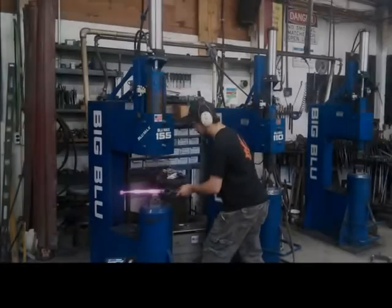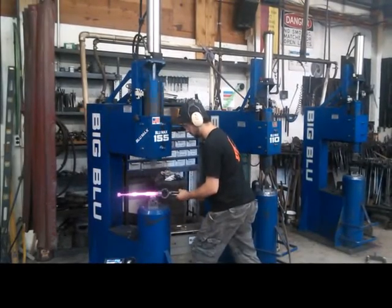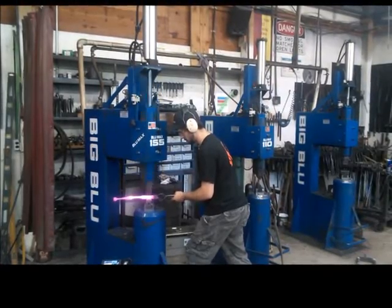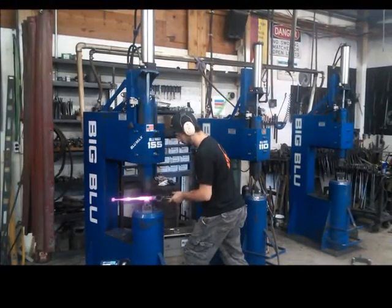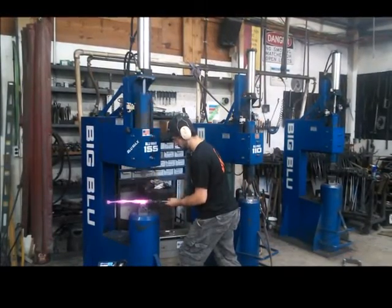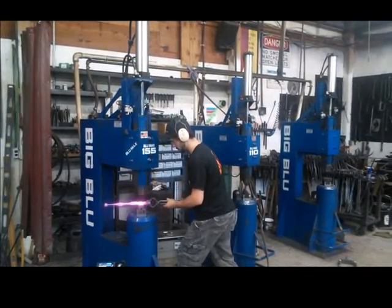But keep in mind that the size of the hammer mark will remain the same even as the diameter on the piece decreases. So to achieve a smooth look, it is often the best practice to increase the speed at which you turn the piece being forged and reduce how hard you hit it as the piece being forged gets smaller and smaller.